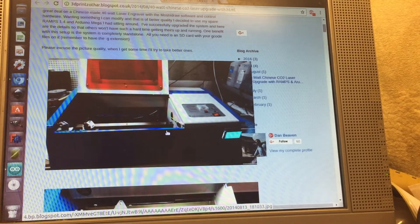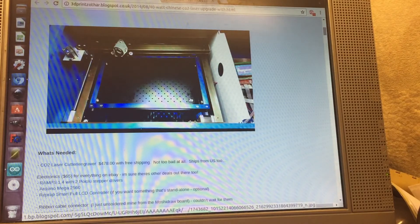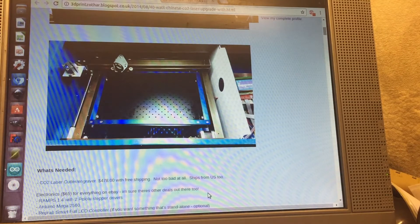The main hardware chunk of this laser cutter is actually 3D printer hardware that's been modified - it's got modified G-code on the Arduino Mega and uses a plugin for Inkscape to create the G-code files using SVG-type graphics. This page runs through an introduction about what they wanted to do, similar to my situation, where they had issues with control systems and wanted to use something open source and Arduino-based. There's a picture of their particular system - it's a fairly generic laser cutter broadly similar to mine, although mine's a little larger with a bigger print bed and a standalone stand.